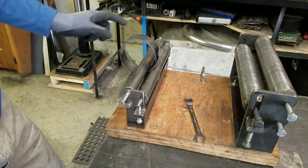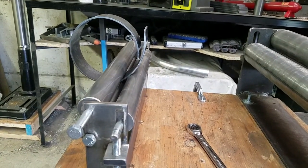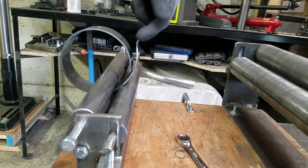And there you have it. You can see that I am a little bit too tight based on the size of my material. As with all slip rolling, you'll have a flat section on the end — I find it easiest to use an angle grinder to cut that off.